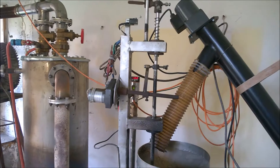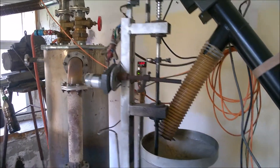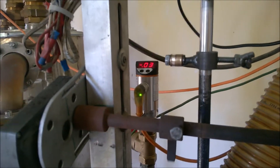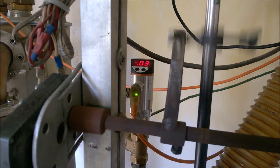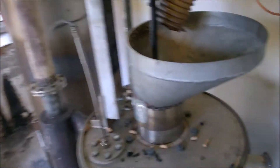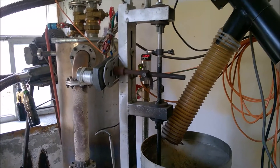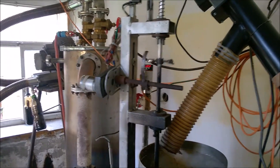It's now two o'clock in the afternoon, and that means we are now firing 24 hours. I started yesterday at two and fired all night long, fully automatically — I didn't touch the gasifier not a single moment. The whole system is controlled by this under pressure sensor. You see now the flicker — by flickering, it sends a signal to my agitator in the gasifier. The agitator keeps the reduction zone fluffy, so the gasifier breathes. It doesn't create hollow burns, and it doesn't create bridges. I'm very, very pleased with this result.